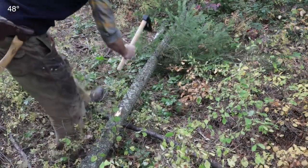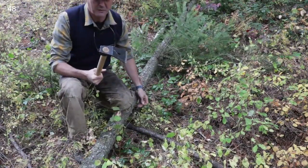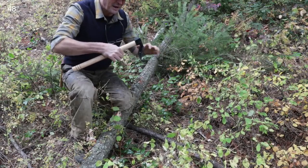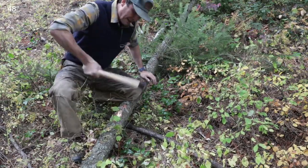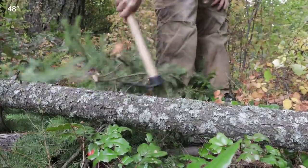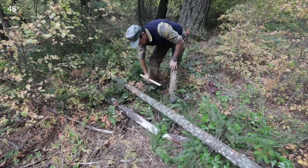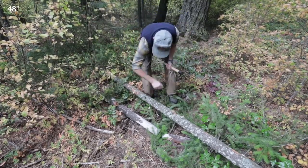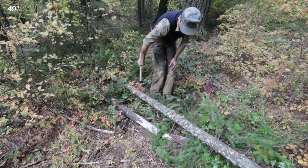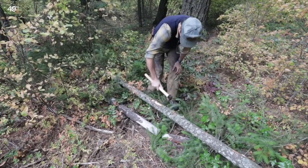Let's see how it works. I do like working with an adze. The thing with an adze — it's so critical and a lot of guys get it wrong. I've had some guys send me ones they've made and they get that angle wrong. If it's too steep, it doesn't seem to work well. It's really important to have the right angle and the right length of handle, or when you come down it doesn't bite properly. Pretty good for chopping off limbs. Of course, it's a very weird angle for the side — usually I like to cut my limbs off on the side — but it's all a trade-off. One interesting thing is that you have to strip the bark off here, and it might be very effective at that.